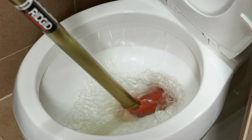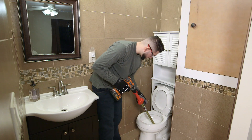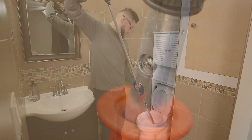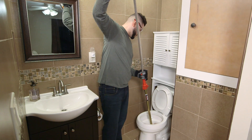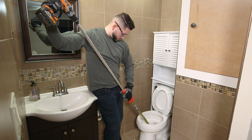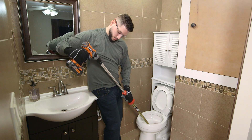Once you've cleared the blockage, flush the toilet to clean the cable and carry any debris on down the line. Now extract the first 3 feet of cable by extending the handle. Unlock and reposition the button. As a tip, to ensure the cable travels up the shaft and not back through the toilet, carefully pinch the cable against the vinyl protector by tipping the auger back away from the toilet. This will lock the cable in place as you return the handle to the low position.